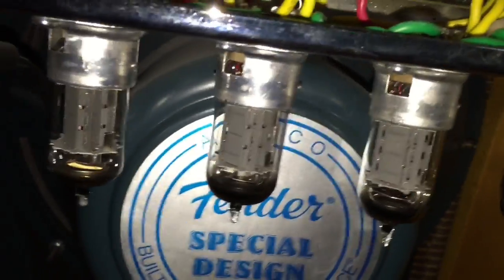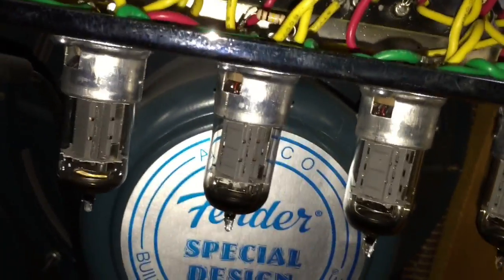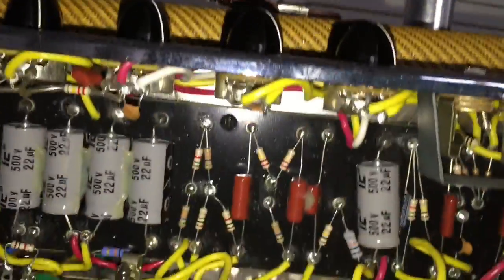Before I checked everything, I had the amp off and I checked the wiring to see if the sockets were okay. Here's the real area, because what was going on with this amp was that in clean mode it was okay, but as you can hear the crackling, it's definitely coming from the preamp section.